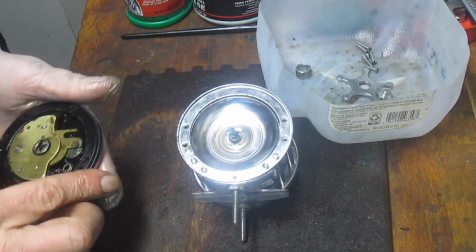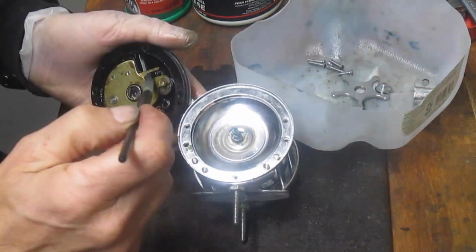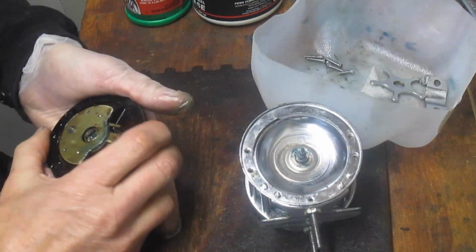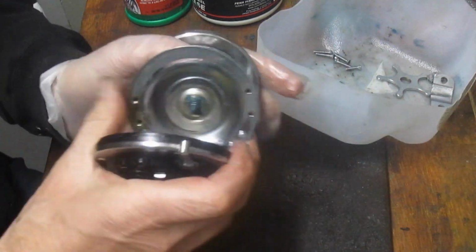Now there's only one other piece here that you probably want to lube. You want to just put a little bit around the crown of this jack assembly here. We weren't able to do that when we were assembling. That's just to grease it where those 2 pieces of metal meet. You'll come back in here and load.